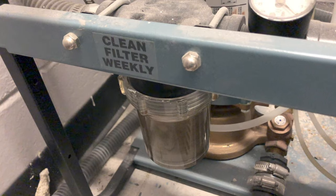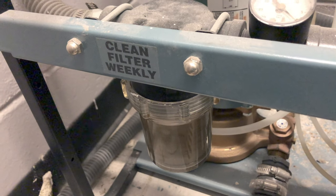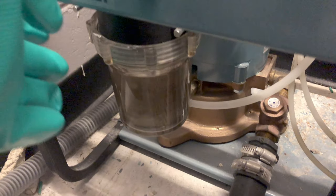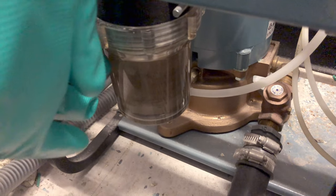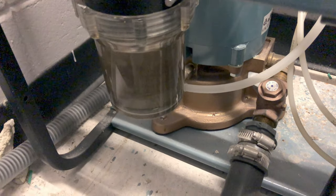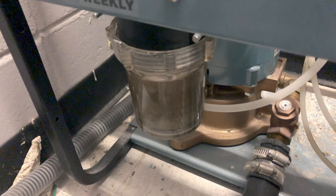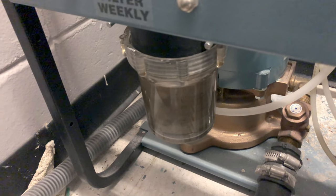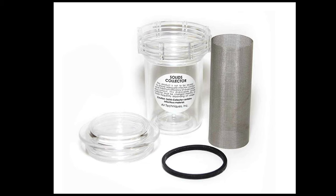One last trap that needs to be checked is the trap on your central vacuum. The trap is in this piece that looks like a mason jar. To check it, you would unscrew this jar, pour out the liquid that's inside, and then clean the trap. They do make disposable traps for this one — the entire jar is disposable along with the trap filter that's inside. That's the easiest way to take care of this particular item. I hope this has been helpful — thank you for watching.